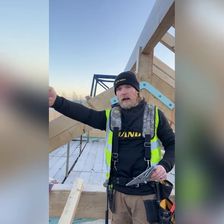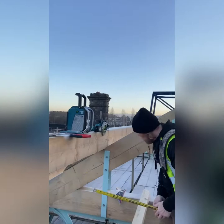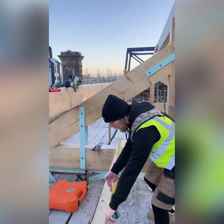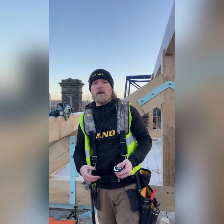So that's quite simple: plumb cut, mark up what your cutout is, offer them up to the top of the roof to mark the plane, mark the bottom of the angle, drop them down, and cut them out. The other way is to get your tape measuring from the corner of your ridge down to the corner of your wall plate, hook your tape over the top where your 20mm mark is, and measure. There are two ways: measurement or in situ. I prefer in situ — you're guaranteed it's in place and you can't go wrong. Hope that helps!